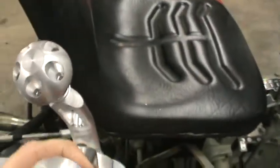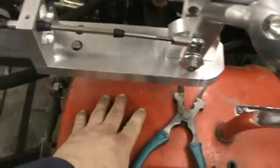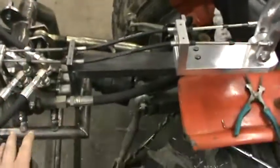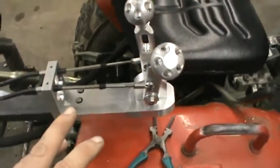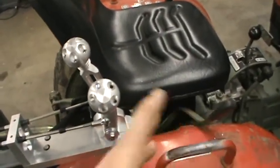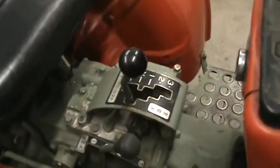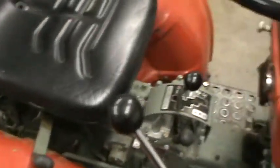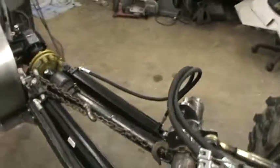I got pretty bored about the ball handles on it, didn't really know what to do or how to make it, but they move very silky. I was planning on mounting it just on the fender and let the cables do everything when the three-point hitch raises. Set the top link right, it raises completely up just for transport. This little tractor does not have an add-on hydraulic for this, so there's just no room — there's so much stuff in there. This is the only implement that I have that requires hydraulics, so that's just why I put the control valve right on the machine.